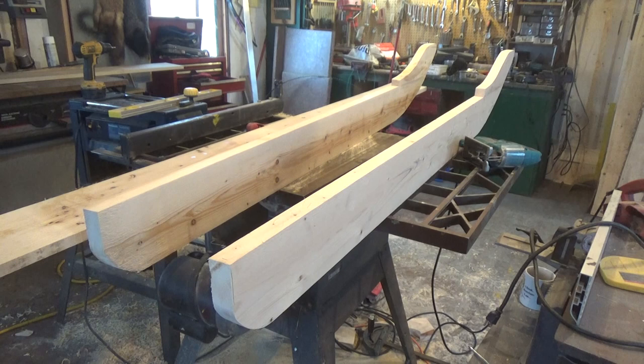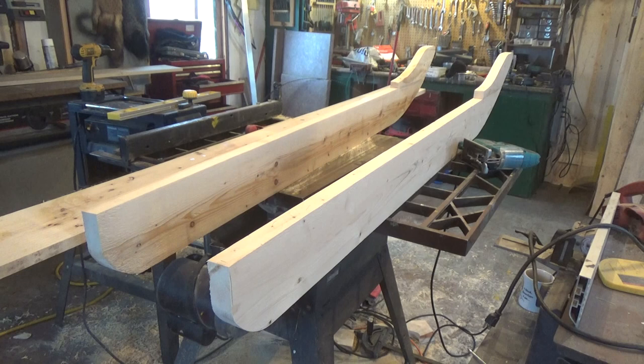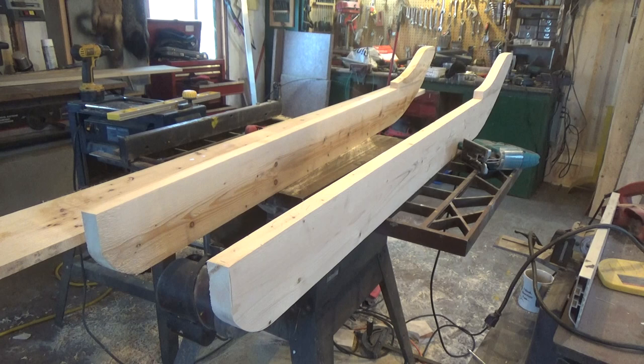So now we have to determine the width. I already determined I want the sleigh 24 inches wide, trying to keep it small and proportional because it's only 6 feet long, and economical as well, because 2 feet will optimize the plywood usage for the box. I'm going to deck this over with 1-inch lumber. It's going to make the sleigh a little heavier, but stronger. You can use 3/4 plywood if you like. Just cut it out to shape and drop it on there.